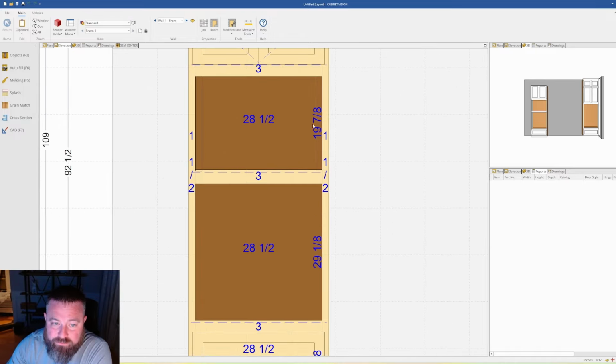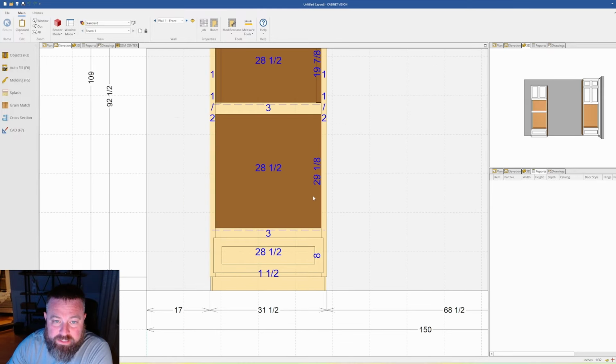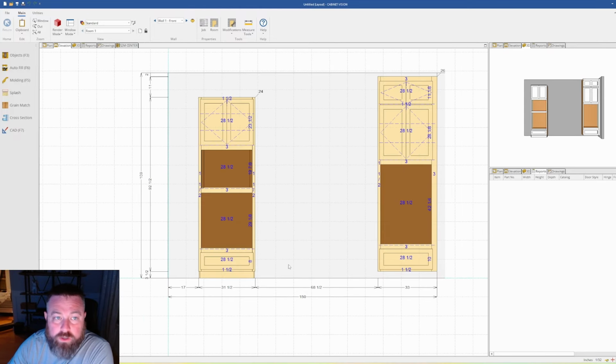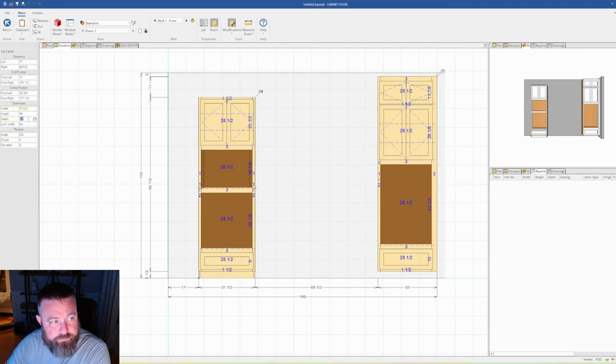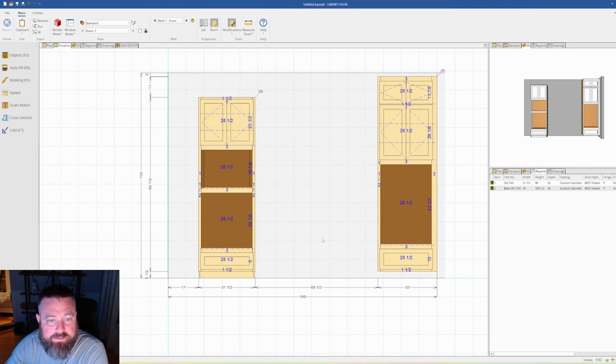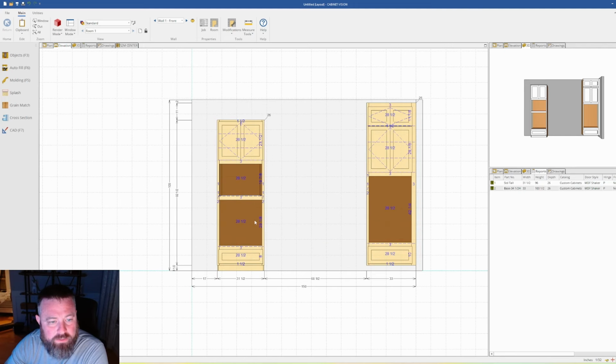But we know that we have our widths. We know that we have our heights. If between 8-inch, 10-inch drawer on the bottom works just fine. I get zero complaints. I do this all the time, unless they tell you something different. That's what I do. And then, you just got the cabinet on top. And again, this one, 26 inches deep if I can. I always do that if I can. And it works out really nicely.